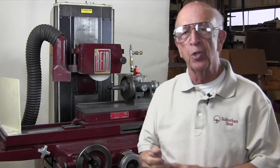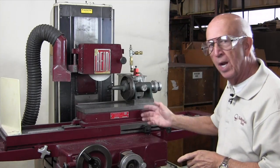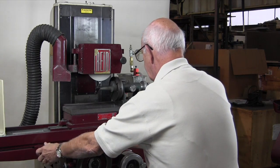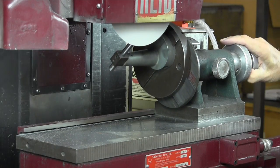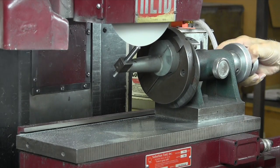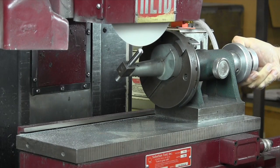So let's go out back and take a look at it. As we mentioned, there are two ways to grind the slot: side wheeling, or grinding it on a 45-degree angle, which is what we're going to do here. This wheel has already been prepared — it already has its 45-degree angle on it — but because we've remounted the wheel, we need to redress it. So we're going to take our tangent dresser, come in here, get it on the center line, and gently come in and touch it. You can hear it's running out a little bit, and you can hear it zinging — you can tell it's a harder wheel than we normally grind with.